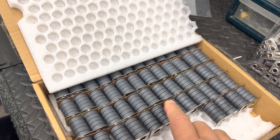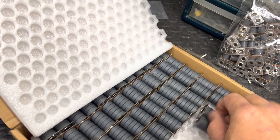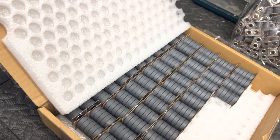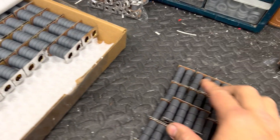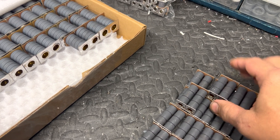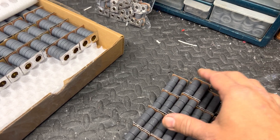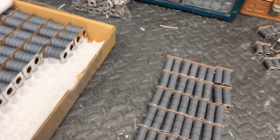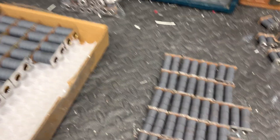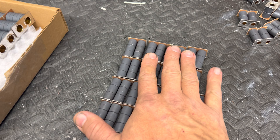Probably 16 pills — I haven't made up my mind on 16 pills yet. But if it's a two pill section build, I'll always use five eighths. Six pill, 10 pill, 12 pill — I use five eighths; they work awesome in six pills. On the four pill section, these inch and a half ones tune out for a little more wattage. It's not tremendous, but everybody wants all the wattage they can get.